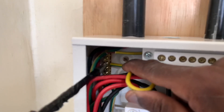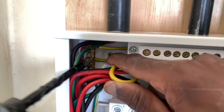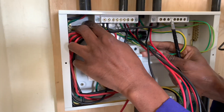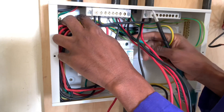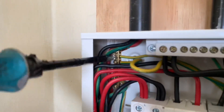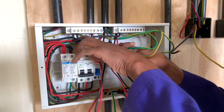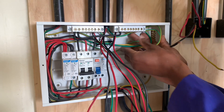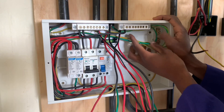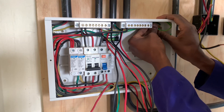So that is my upper connection, still ensuring it is tightly done. Then the other wire, I have it go all the way in. Now having connected those wires, I will make sure that I create room for them so that the future electrician will have an easier time and can make use of some extra wires there. I will have them coil all the way there and make use of that space.